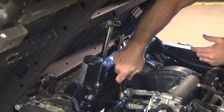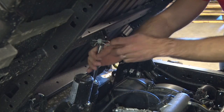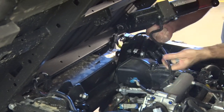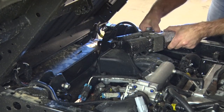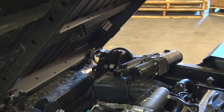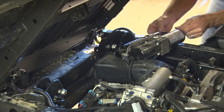Disconnect the harness from the actuator. To do that, we have to clip a zip tie too. So next we'll start pulling pins from the actuator, get the actuator out. I'm going to retract the cylinder while it's plugged in so it's a smaller space. You can replace the pins in the actuator, or put them back in the gator as well if you like, just as long as you don't lose them.